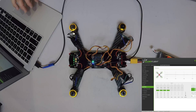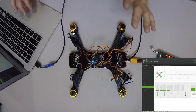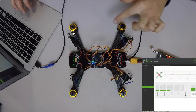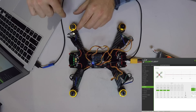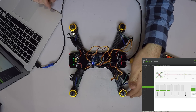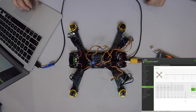Now we've got the motors just spinning. You can hear their bearings whirring. You want to test to make sure they're spinning in the correct direction. Motor number one needs to be spinning clockwise — put your finger against it and feel which direction it's moving. Number two needs to be going counterclockwise — it is indeed spinning that direction. Number three needs to be going counterclockwise — yes, same direction. And number four needs to be going clockwise — yes, same direction. So now go ahead and turn those motors off.